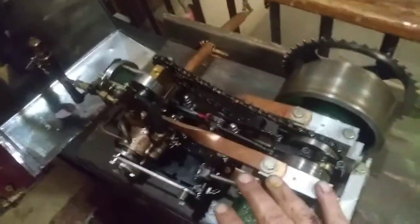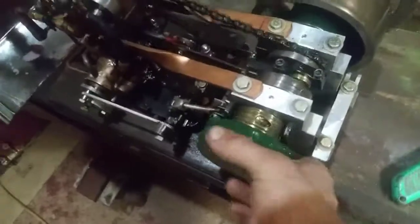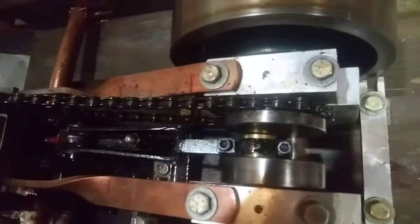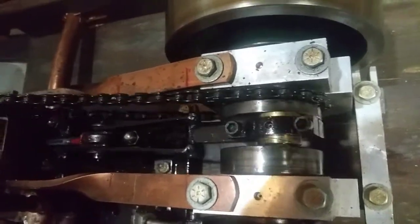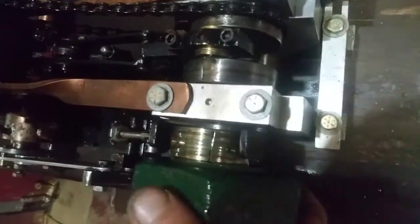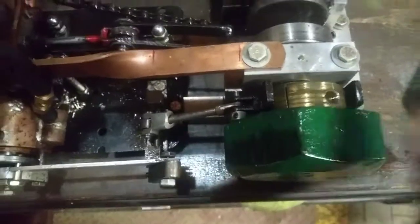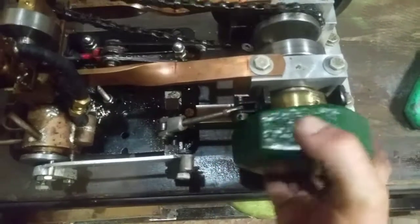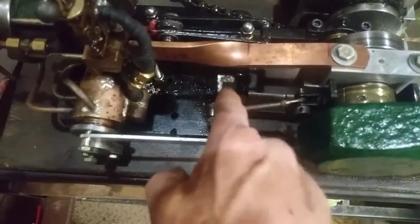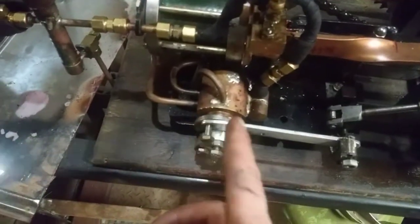So I started with the crank. I knew I wanted a two-inch square engine — a two-inch stroke with a two-inch diameter piston. I got this bolt from the recycled steel place and machined it into a crank on my 1930 South Bend lathe. Then I made this cam out of brass — a big chunk of brass. I machined it and bored it offset, and that moves this lever here. I ran into some problems with the stroke on this cam, so I had to compound it and make an intermediate lever here.